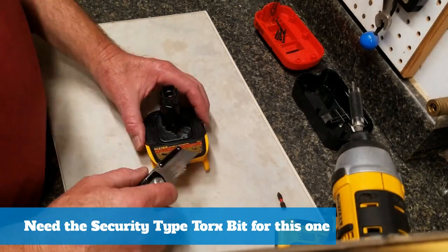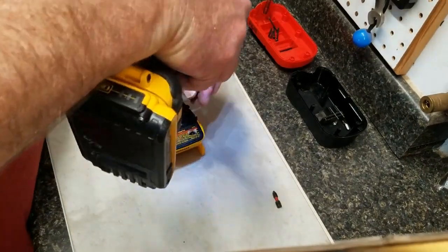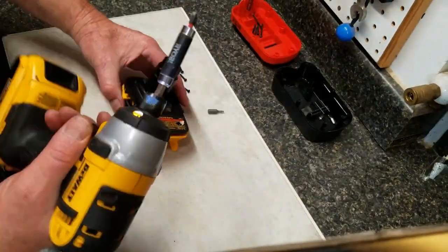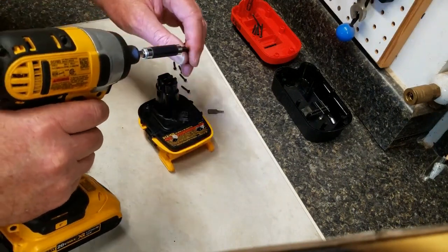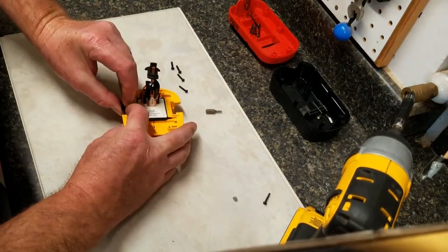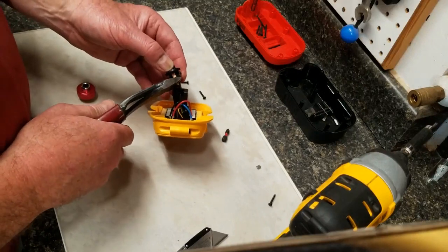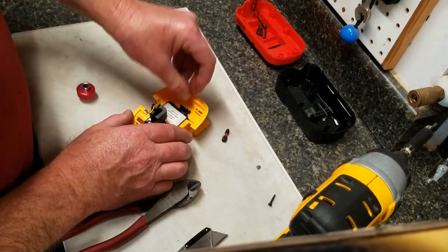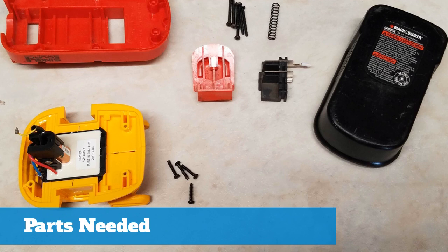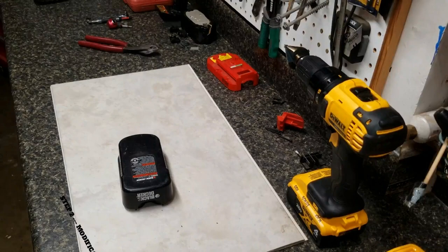Next is the DeWalt adapter. You need a hollow tamper-proof security bit to remove the four screws, then pull the bit loose and switch to a standard Phillips to pull that one out on top. That lets you remove the top part and get those clips out of the way — the buttons that lock and unlock onto the DeWalt tool. Clip the little yellow wire and larger black wire as close to the top as you can to leave yourself the conductor wire. That's the disassembly done; this is what we'll use for the project, and the rest gets thrown away or recycled.